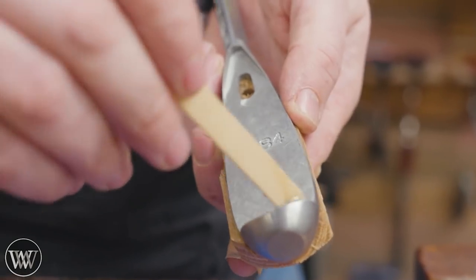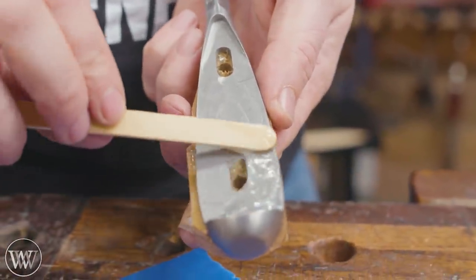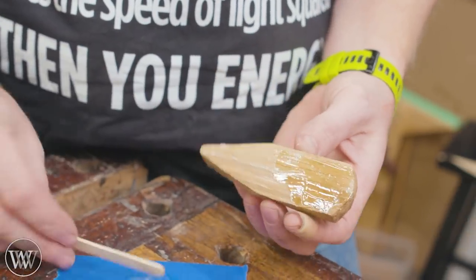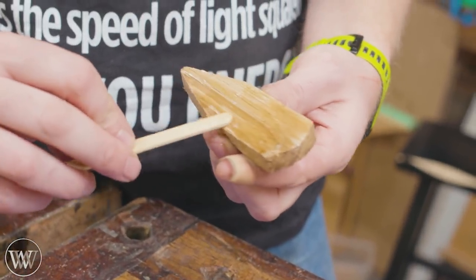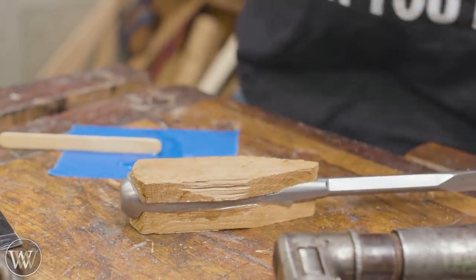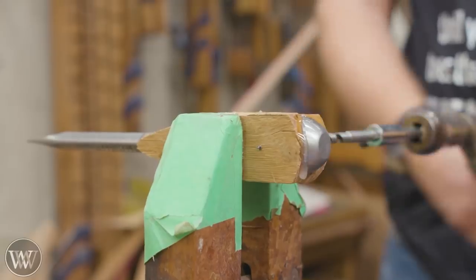Apply the epoxy onto the second side, and then clamp that down in. Second verse, same as the first. Don't worry about it being overly heavy. We're going to file and clean this off, so if it squeezes out, more the merrier. There's really no specialty to this. Pound it down in place, and then clamp it in, let it sit until it is fully cured.